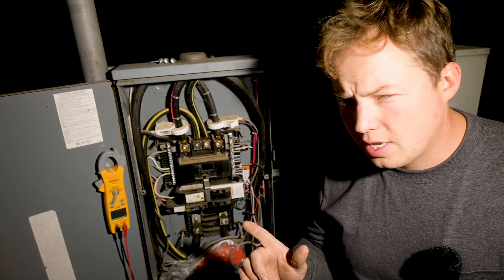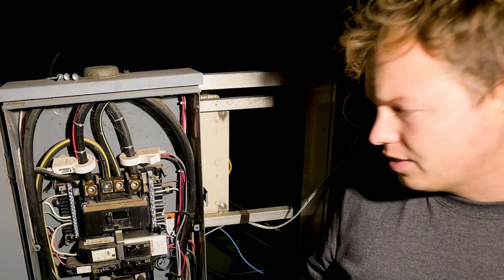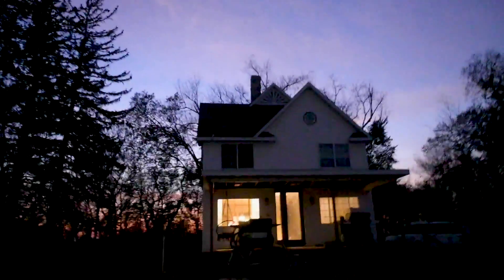Based on that testing, we know that our cord is fine because we're getting our voltage to the breaker. But for some reason I'm not getting the voltage from the breaker to the rest of the system. Naomi just said that it's time for supper. So let's go have supper. Super weird though — this is completely unexpected. I thought that this was just going to work. At least one leg is working, so half of the power is on.